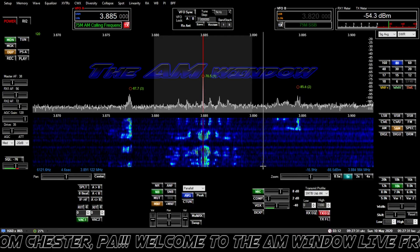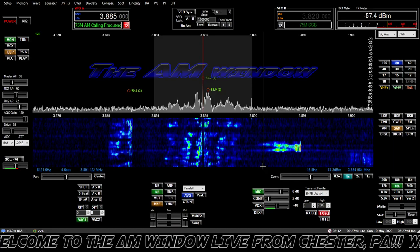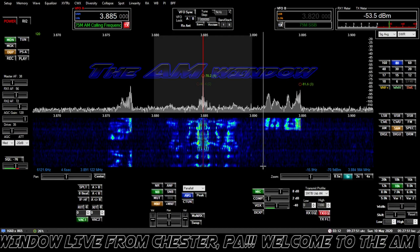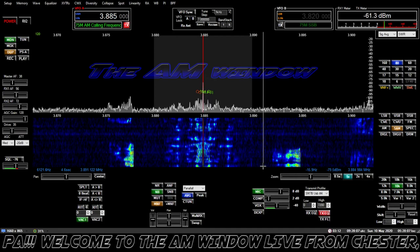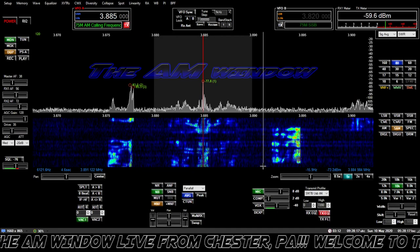Okay on the 101 there on 40 meters, and like I say, you're sounding good over here. I mean, I can hear you fine. It's just I didn't have enough sauce to get a signal back at your direction. And with the 10 meter openings, that's 11 year cycles. The sun goes through the 11 year cycle, but once it hits the peak, then it really starts dropping off quickly. And there's not much openings on the downside. Now on the upside, there are loads and loads of sunspot activity, and you get some great, great conditions, you know, worldwide conditions there on 10.